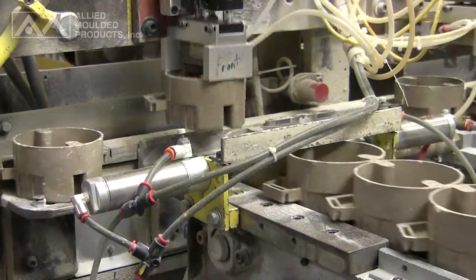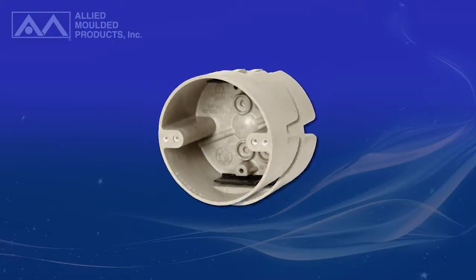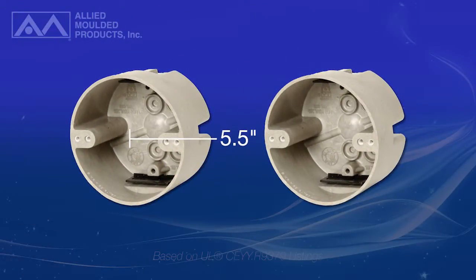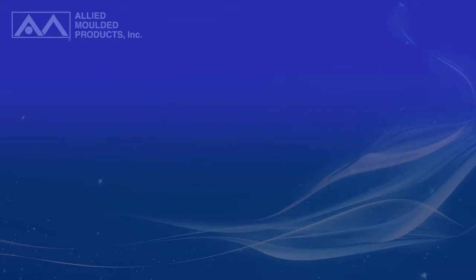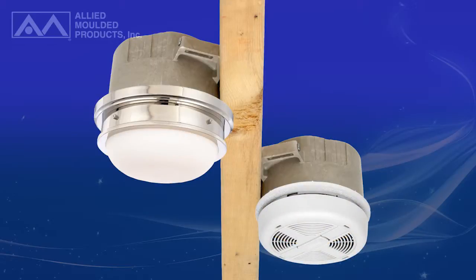Manufactured with the same material and professional development, our series of fiberglass ceiling boxes can be placed five and a half inches from each other, in solid wood or pre-engineered wood joist fire-resistive assemblies, measured from box center to box center. This means you can install a luminaire and smoke detector on opposite sides of the ceiling joist, without the use of fire-resistive materials.